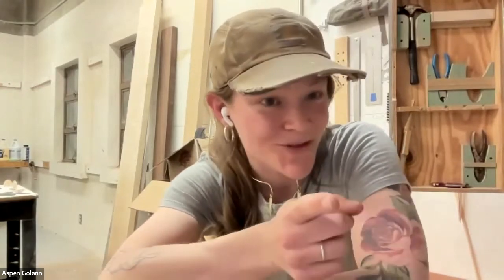And also to give credit where credit is due, Will Neptune, if you know of him, he's the one who came up with or discovered this process. And I think he worked backwards from the spar gauge, and then observed quite a few legs. There's a few cabriole legs in the Yale furniture study that were clearly made with a 6-6 mentality. You can feel they don't have that impossible sinuous quality. They have a square, blocky feel.